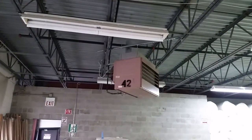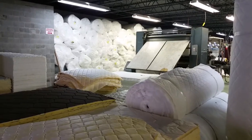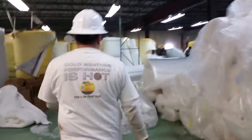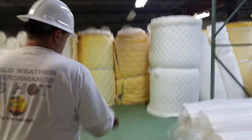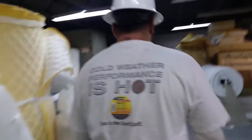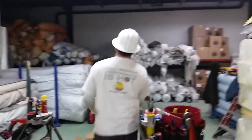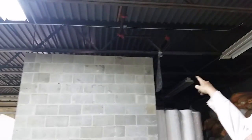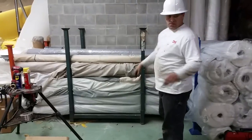Take a look at the heater — it's a bad boy. She's blowing hot air right on Miss America over there. Here's what we got going over here — we're putting another heater in. This is a smaller unit, but a little bit of a pain in the ass because it's got 120 volt. We piped in our 120 coming into the unit. That's gonna be the disconnect switch. I'm gonna whip out of that right to my unit — it's gonna hang right there. I figure this is a good location.